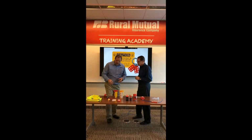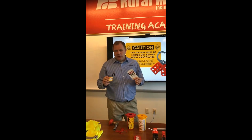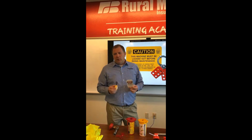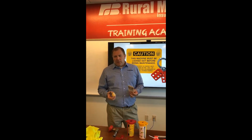Sure, absolutely. The thing to understand, whether we're talking about locks or tags, is at the end of the day we want to make sure that whatever device is being used is traceable back to the employee that applied it. So what we don't want to do is ever remove anything without verifying that the employee that placed that is no longer in harm's way. There's a couple of ways that you can do this.